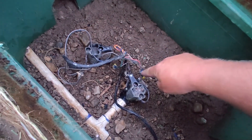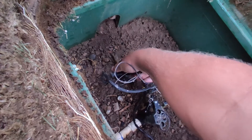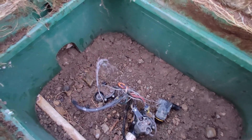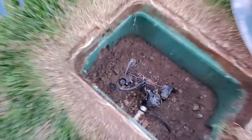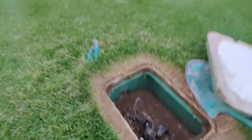Somebody glued those fittings in there. We're going to swap these solenoids — put that one on there and then wire it up. Chances are it's going to work. That's how easy it is. You just unscrew it, screw the new one on. But you've got to turn the water off. Otherwise this little stream right there will be gushing up and it will be hard to screw that back in. So turn the water off before you unscrew it.